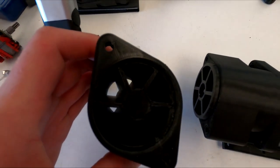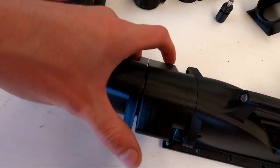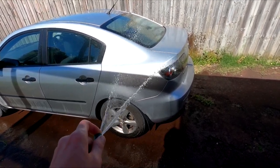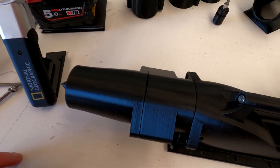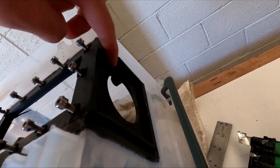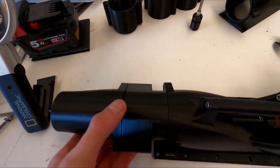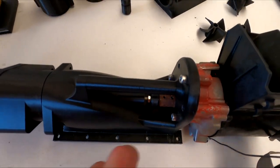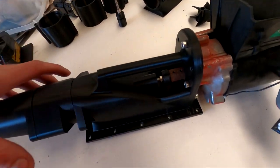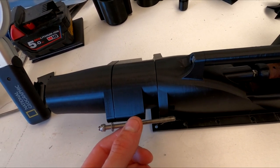After that, I then go to the nozzle, to which the nozzle's job is literally just to restrict it and increase the velocity of the water. So that's the assembly there. Why this has a gap is the mounting plate actually goes between them and it sandwiches all together, holding it all locked in, as well as the bottom bolts on the intake here actually bolting into this. And then these are held together with just some all thread with some nuts on it currently.